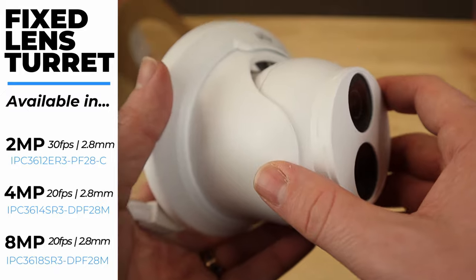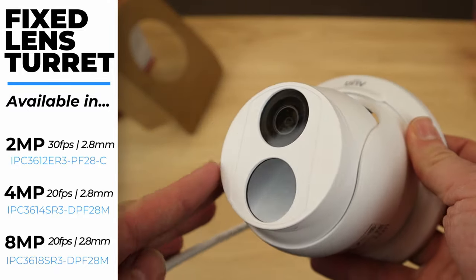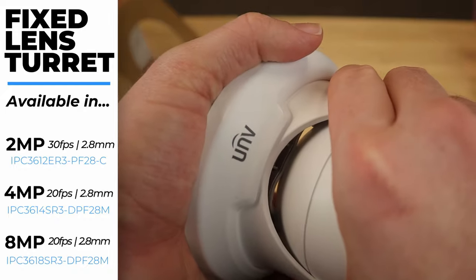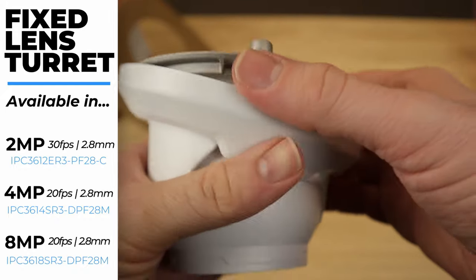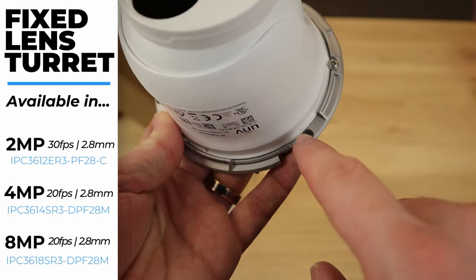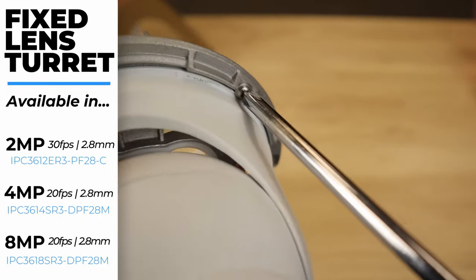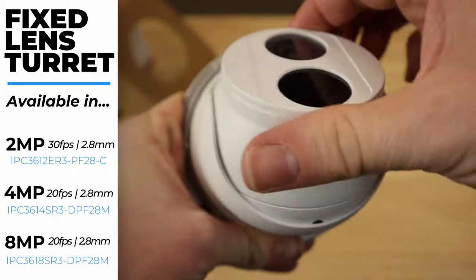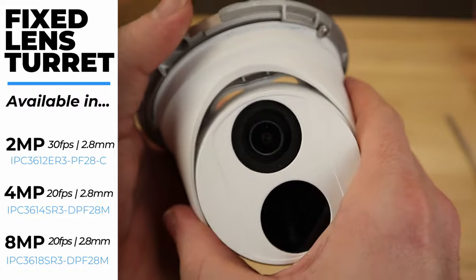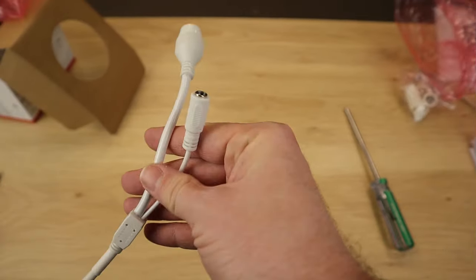So that's full HD 1080p, 4 megapixel, or 4K Ultra HD — it's all going to be that nice wide 2.8mm lens. To open this and take the cover off you just need to turn it counter-clockwise and it slides right over the camera. Underneath you can see the three screws which is how you install your turret camera. We also have a tension screw on the side. Loosen the tension screw and we can easily move and angle the turret however we need to. Like the bullet, this turret only has an ethernet connection and your 12-volt DC connection.